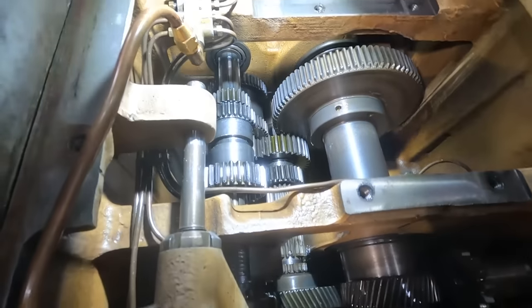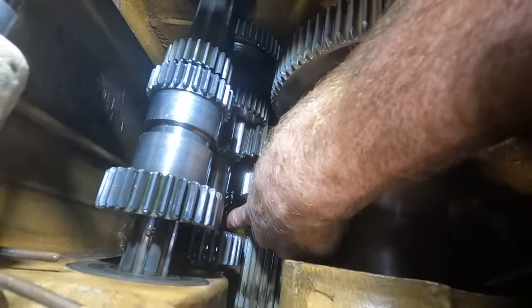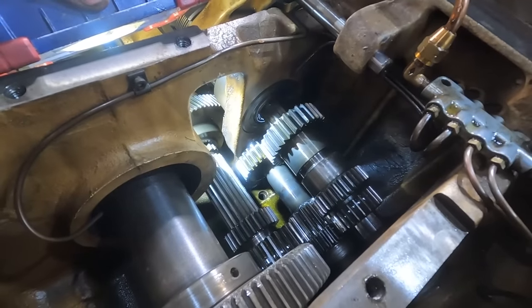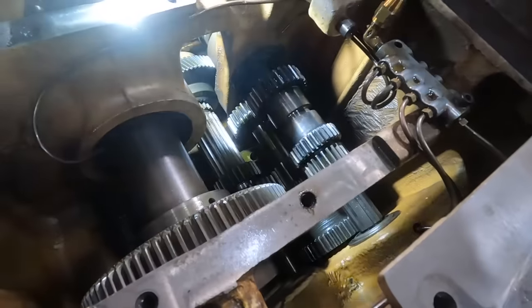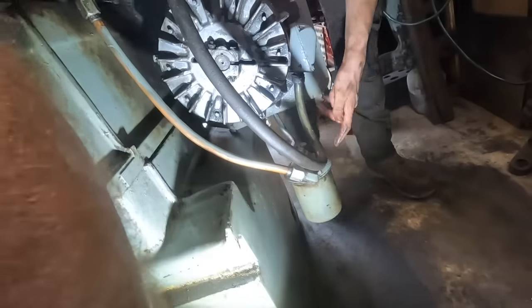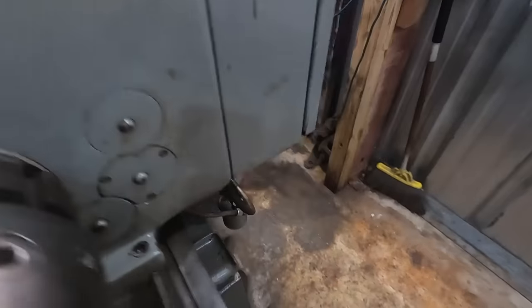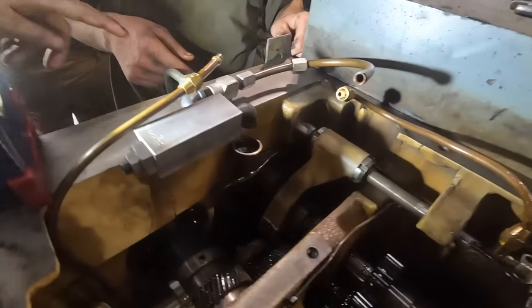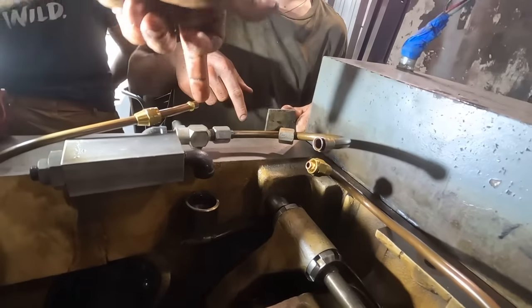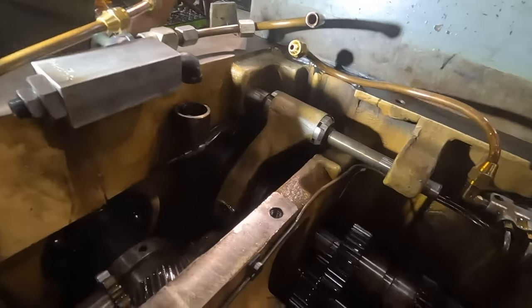So what I'm really looking for here, okay, what's that? Right down there, there's a hole. You see that hole right in the middle of the screen? Where's that go? That is at the drain. There is a plug over there. Goes to this filter. Okay. It goes out. So that hole is where the oil goes down through to the filter, and then the filter brings it back up and comes through that line there, which probably comes up to this T and goes into that head and dumps down into that cup to feed those. Looks like there's some clutches back there.